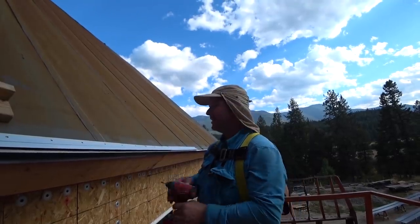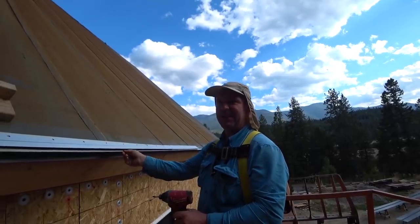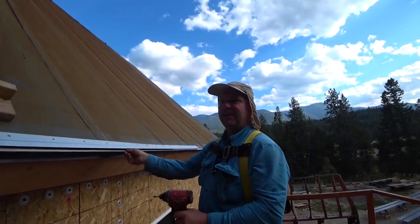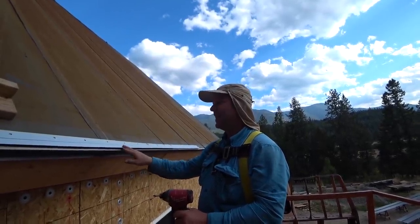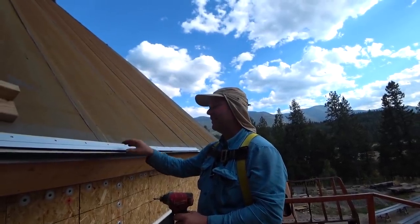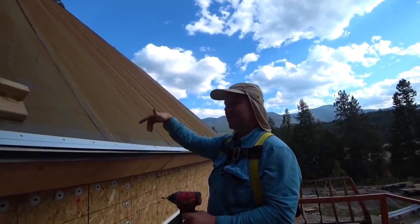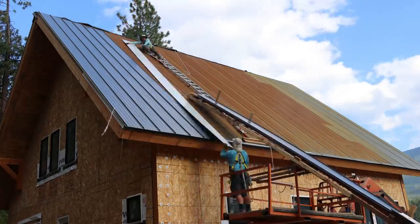And it crossed my mind to try to hem to this drip edge, but if you feel under there, there's only about 3/8 of an inch. And I'm worried that in a high wind area, a 3/8 inch hem is not enough. So we're having to find that happy spot between the roofing length, the drip edge overhang, and the offset cleat, where it'll get a good bite into the roof underlayment.